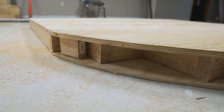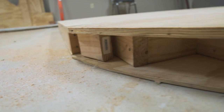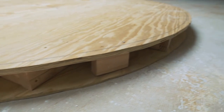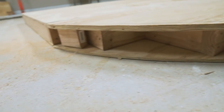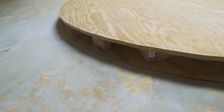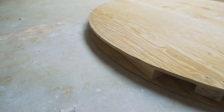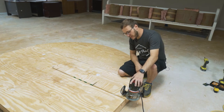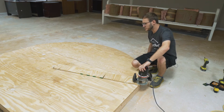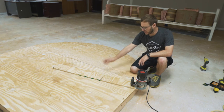Here's what our finished platform looks like. As well as adding extra boxes on the ends, we've added a couple of support pieces of 2x4 on the very ends and along the outer edge for a little extra support. The 3/4-inch plywood is actually pretty sturdy, so if there's not a lot of weight on those ends it may not be completely necessary. We'll be adding a skirt around the end — just getting some really thin plywood and bending it around the front to cover up the insides.